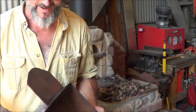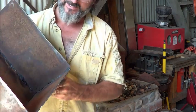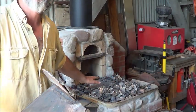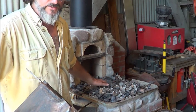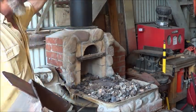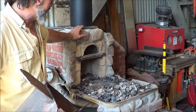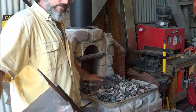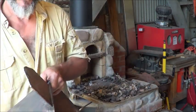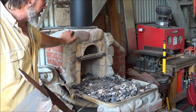Let me talk about my little spark box. It's made out of heavier steel than it needs to be, but it's all I had. My daughter, on her first use of the plasma cutter, did all the cutting - I welded it together. The concept of the spark box: I start my forge with charcoal, and charcoal sparks. I don't want sparks near hundred-year-old wood with a massive facility next door. So I can get the fire built, get the charcoal going with some coal on top, put this spark box right over it, and let it go until it's ready to forge - nice and clean, no errant sparks. It also forces the draft right up the chimney, which works really well.